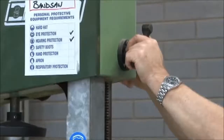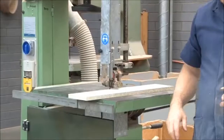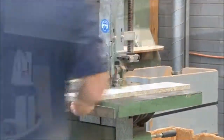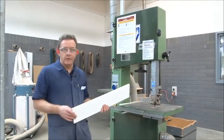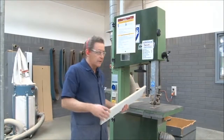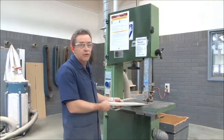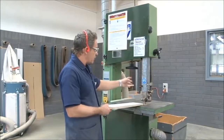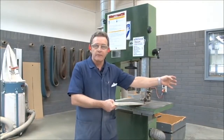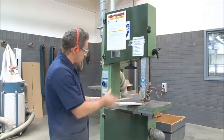Once in place, lock it in, and we're now ready to cut our material. From a safety point of view, the first thing you need to be sure is that when operating it, never stand to the right of the machine, because if a blade should break, the direction it will go is actually out to the right. So always stand this side of the blade.